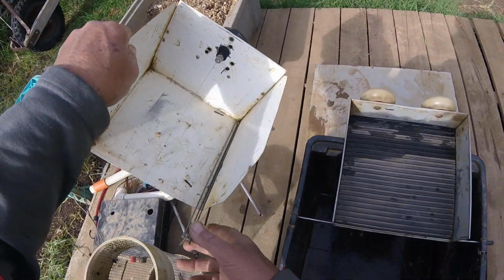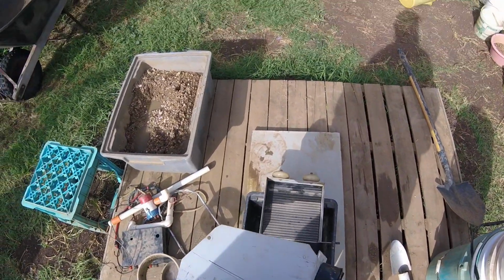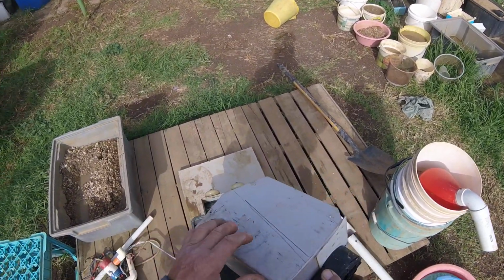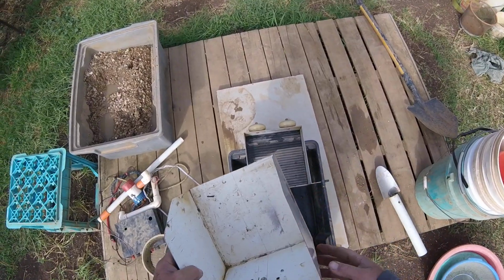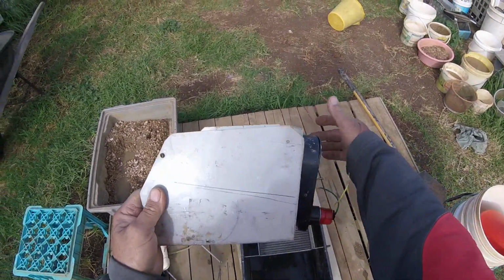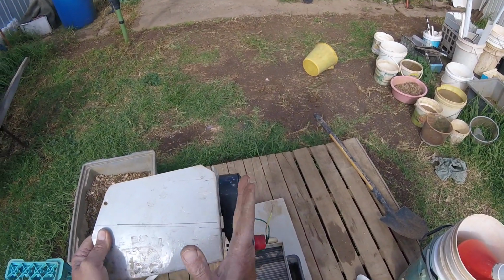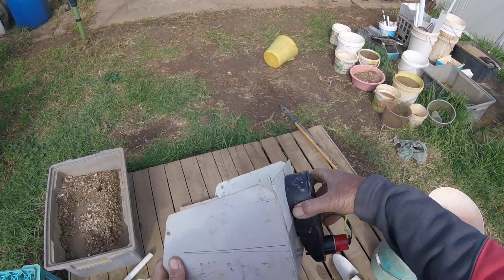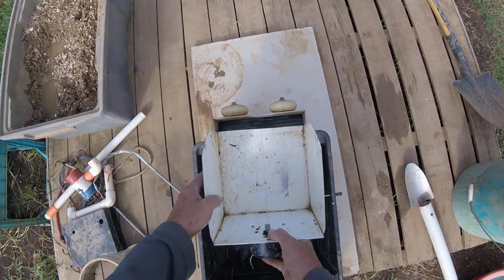This is the hopper. Again, a piece of sheet metal. I'm using, I don't know what it is, but you can get it off a washing machine or something. So there's my hopper. Again, I don't know, 200. Bent into that shape. It's not a square box. This bit here is on a slight angle there, because when you lift it up it becomes square. Anyway, and that sits in there.